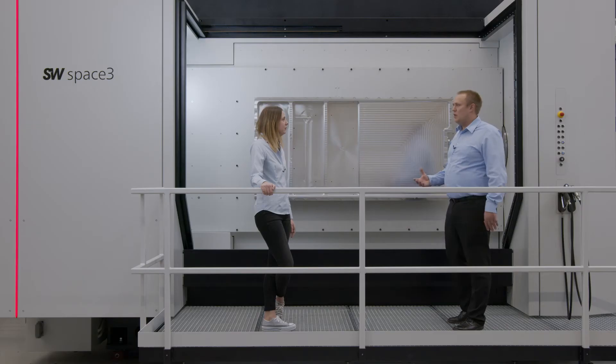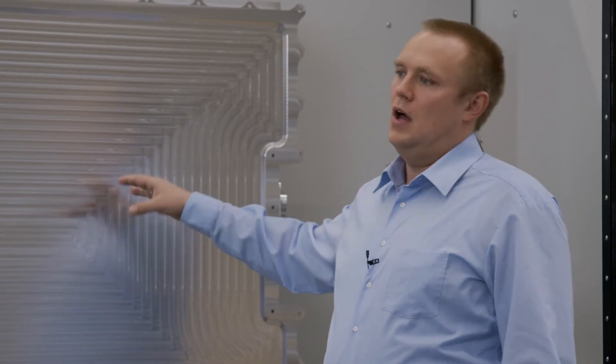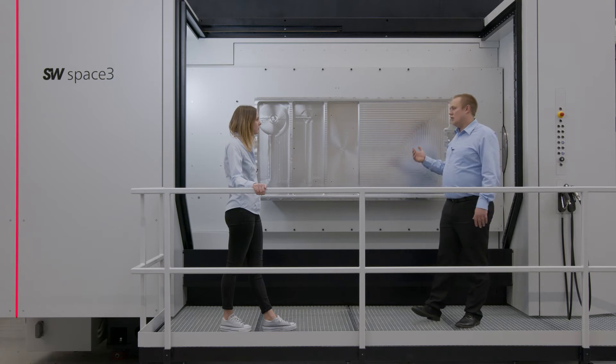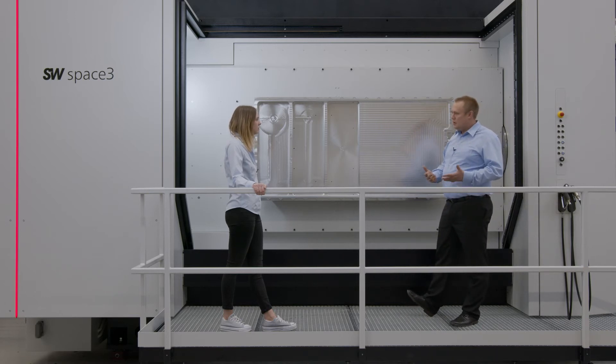Exactly — this is one of the challenging things with these parts. First of all, clamping is very important. The clamping can be done hydraulically, or what we prefer is vacuum clamping. There are vacuum nozzles on the back side across many areas which hold down the part, and then it's blocked hydraulically on the left and right side. This is the first step to achieving good accuracy. But after the welding process, the cross beams and side wings are not accurately positioned because weldment always introduces a certain inaccuracy.